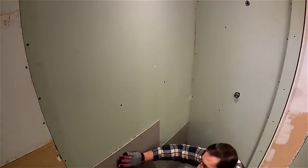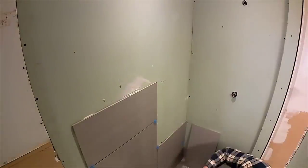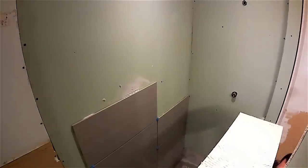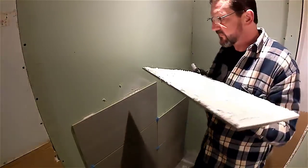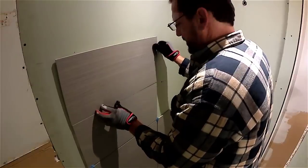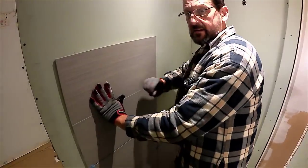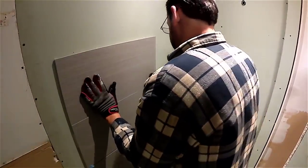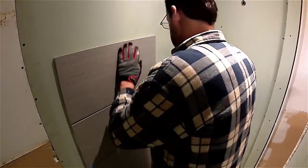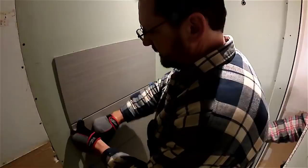We're installing the 12 by 24 inch tile in the shower, all the way up on all three walls. I'm using one-eighth inch spacers for the grout joint. They're actually pretty heavy tiles so you want to make sure you get them back-buttered really well with the mortar. I'm pushing them into place — you want to pound on each one and put some pressure to make sure you get a nice adhesion to your drywall, then push it up to allow for the space. It's a beautiful tile we found at Lowe's — the link is in the description.